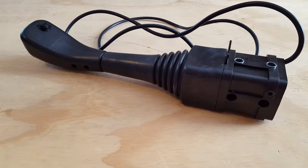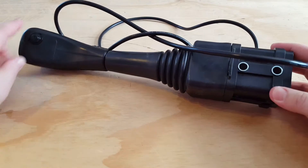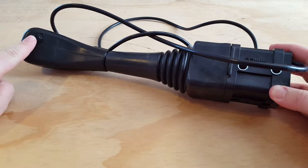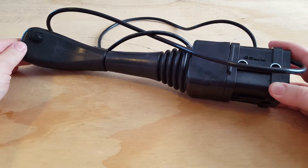This one-button Nimco joystick control is used with front-end farm loaders that have a grapple but don't have a three-spool valve. When you have a cable-operated joystick with just one electric button for the grapple third function, you're adding third function capabilities to a two-function manual valve.